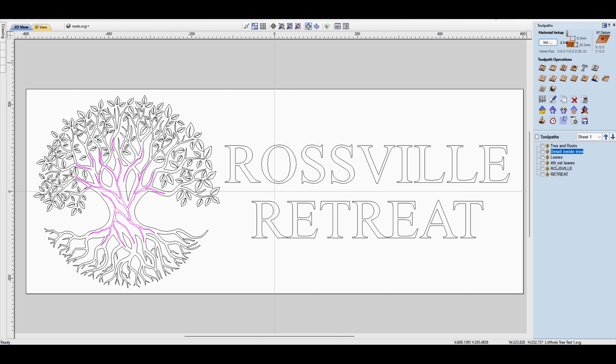For the leaves, I selected all of them in one go. That was the first toolpath I ran, starting on this side. One important tip: when you get your zero on your Z axis, lift it ever so slightly higher than the actual starting depth — that gives you a margin of error. If you missed the true highest point somewhere, being a little higher means you won't lose as much detail. You can always lower the Z axis again and run the same toolpath, getting better detail as you go down until you're satisfied.